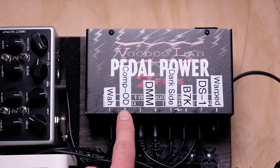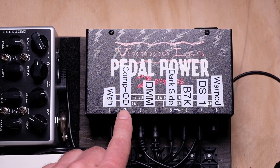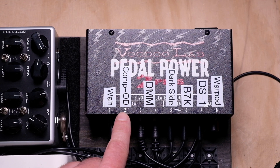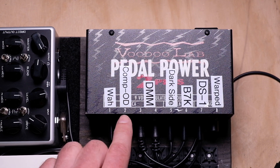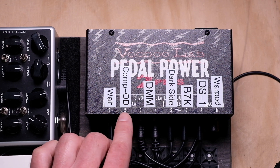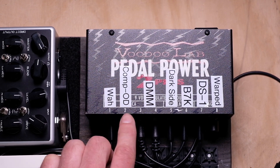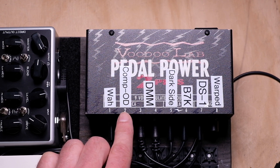Let's talk about making intelligent decisions about which pedals to combine into a single port. There are some general guidelines for what you want to mix and what you don't. In particular: don't mix two or more digital pedals together, don't mix an analog and a digital pedal together, and certainly don't mix DC and AC. I generally keep vintage-type stuff — wahs, fuzzes, anything germanium-based — isolated and not mixed with each other. Also be careful with modulation effects — basically anything with a rate knob — because those can get weird when sharing power. Best way to do it is just experiment: run the power, put two cables in, and if it introduces noise or hum, try different combinations until you find something that works.